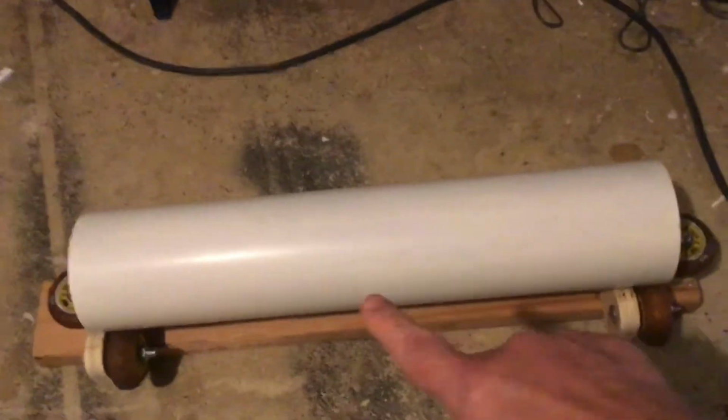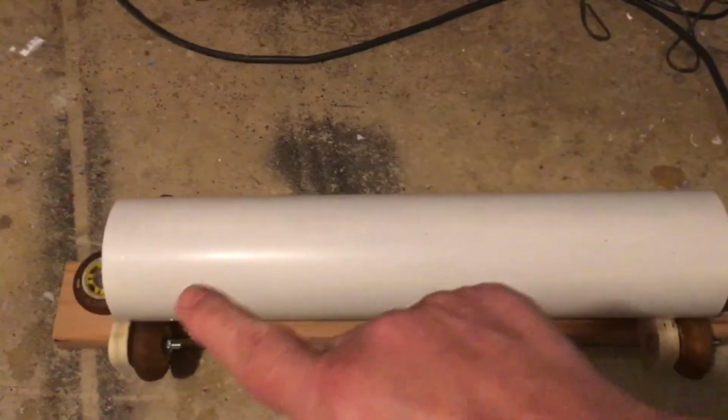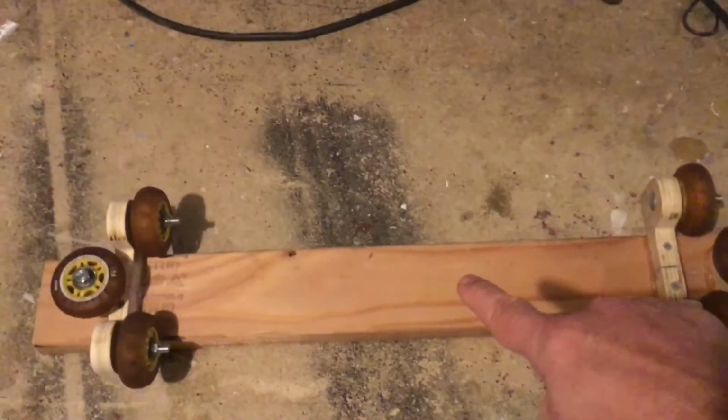So this I will put on the PVC pipe. So now I can like roll that and that'll stay in place. And that is the jig I'm going to use to wind. That's the pipe I'm going to use for the secondary coil. So I'm going to use that to wind the secondary coil. So more than likely, that will just get screwed right down to my workbench when I'm ready to do it. And then that'll go on. And I'll find a slow running electric motor, put a wheel on it to put on here to turn that, probably put a foot pedal switch on it so I can turn that on and off with my foot pedal while I wind the copper wire along that.